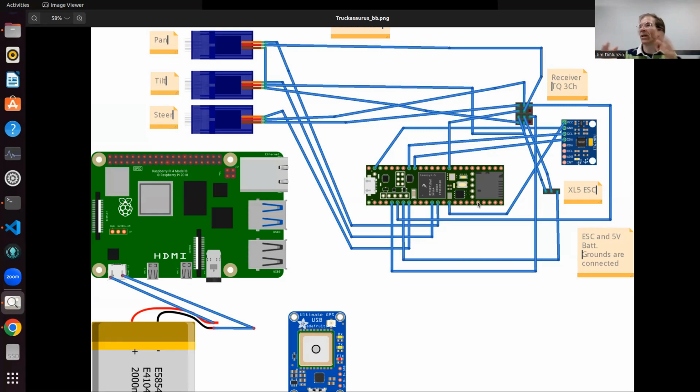So it doesn't build up acceleration, like, hey, I'm not moving, it must be really sticky ground, and goes up to full speed, and then when you turn it on again, it zips away. That wouldn't be a simple if-then-else statement to code. Well, as long as the system knows there's an emergency stop happening. But right now it's at the microcontroller level. The upper level system does not know it's just been stopped. It doesn't have any idea. It just knows that it's not moving, and therefore the upper level system might say, put more power in because I'm not moving.